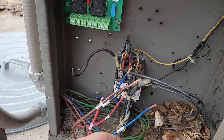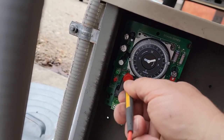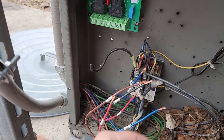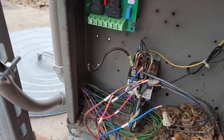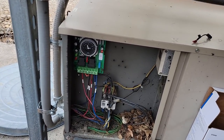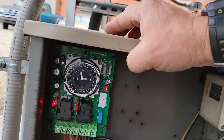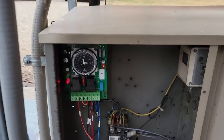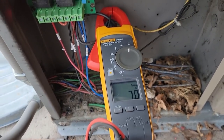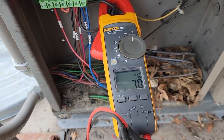I checked both of them to ground and had nothing, so it seems like we're fine. I bet we had a loose connection of some sort. I went ahead and wired it up - I did my due diligence to make sure it wasn't a dead short, and currently it does not appear to be. Let's put her in defrost - there she goes. Make sure she pumps down. No interlock, so it can run either way. We've got the heaters technically on right now - it's pumping down until that pressure switch cuts out.